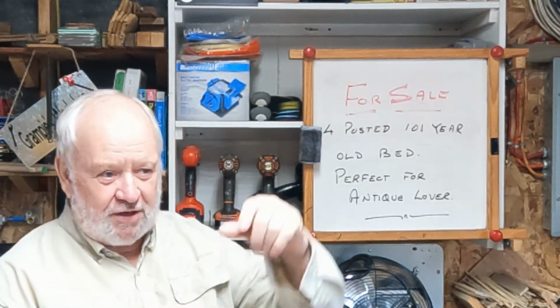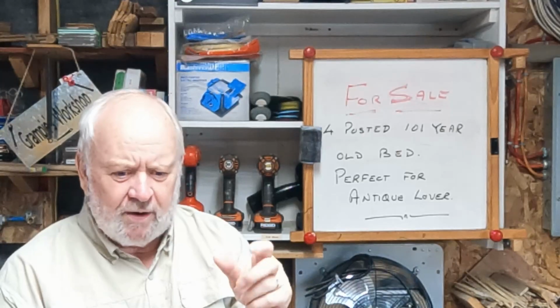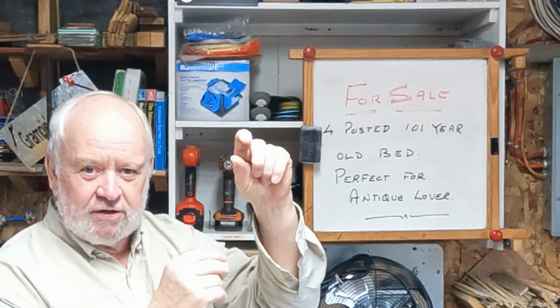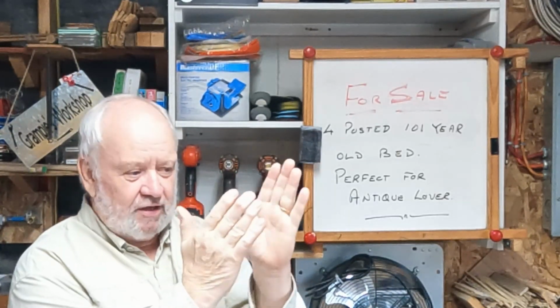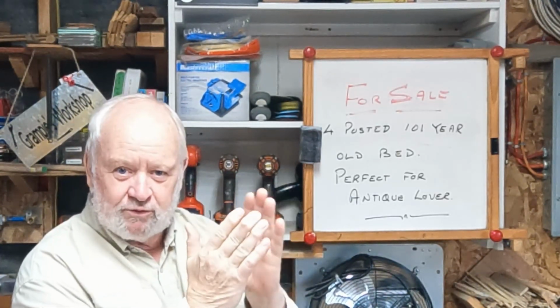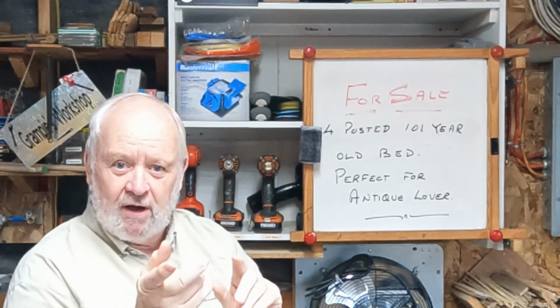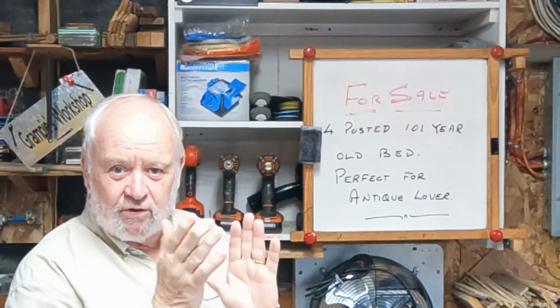You know, another reason that I wanted to put that latch on there was that hook and eye assembly. That worked great, although you had to stretch to open it. But when I remounted the doors, I didn't get the eye set quite in the right spot, and it was a little bit loose, and the door would flop when it was windy and rattle. And every now and then it would rattle so much that that hook would come unhooked, and next thing you know, the door would really start to move a lot. And you can see it moving from the camp up here on a windy day, and I didn't like that.